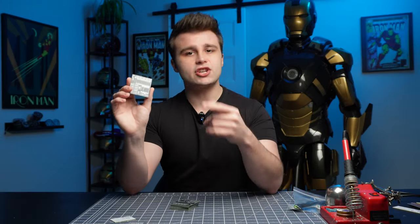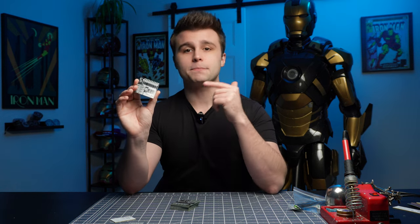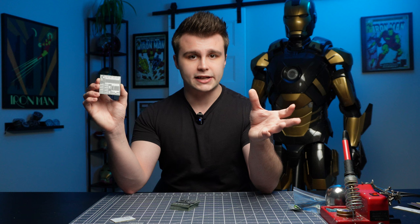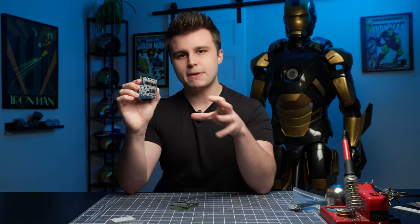That means I don't have to splice any wires — I can just buy a USB Micro Type-B cable and plug it right into the board for power. The second change I implemented was recommended by a user in the comments of the last chest motorization video: I added a capacitor for the power. It basically works as a mini battery for the board — if there's a huge draw of power because all eight servos are working simultaneously, power will be drawn from the capacitor and should keep everything running properly instead of having voltage dips and the Arduino resetting.